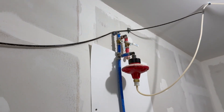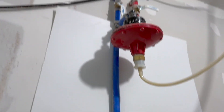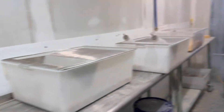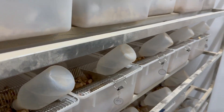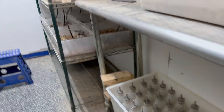You can see here I have my water lines run in. That is a hot water line if I ever want to use it, but I just capped it off — it is there if I want it. That is a pressure reducer — you reduce the pressure and then send the water lines out, and that's what everything is plumbed to. So it is all pressurized but at low pressure on the nozzles. No more filling with pitchers and buckets. I do have some that are still on bottles just because I haven't plumbed the rest of the rack yet, and I hate those bottles — it's a constant job. That one's empty, that one's empty — every day you just have to check all these bottles and fill them up.